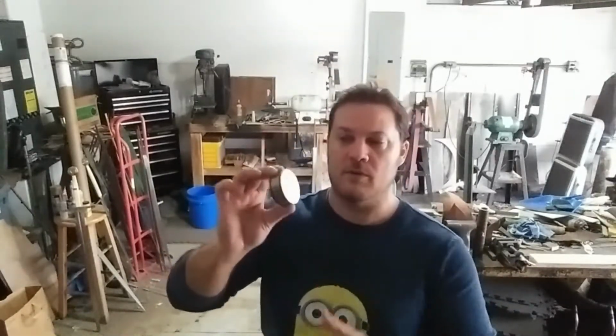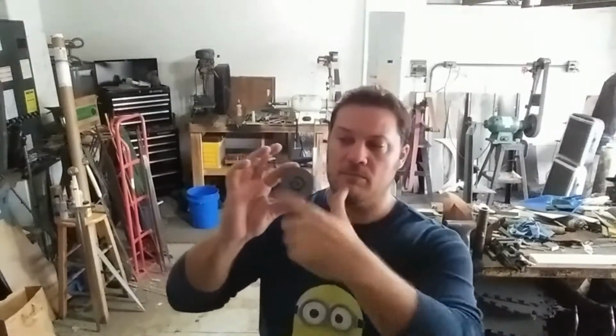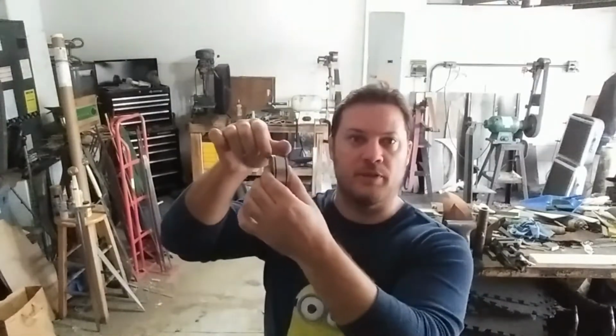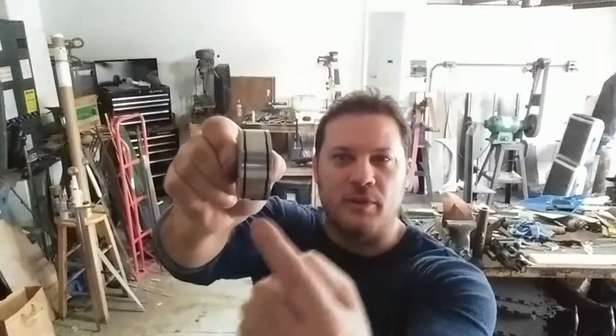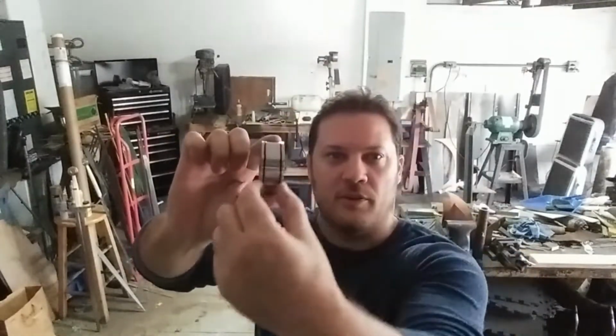Now, on this particular pommel, for the historical version, the bevel is not the same all the way around. It's a very shallow bevel at the top, so the top of the piece will be a bit wider, and at the bottom of the piece the bevel is a bit steeper. It's very subtle, so we drew the lines there, marking out our center piece that's going to be flat. These lines do taper as they get to the bottom. It'll probably look clearer when we actually do the grinding.